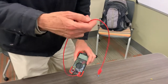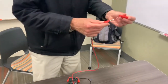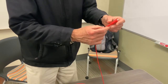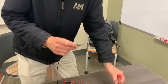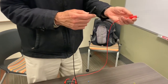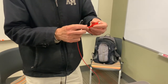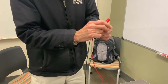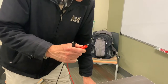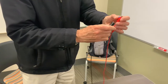On the other side, we're going to insert alligator clips. You have to make a good connection to the alligator clip — push it onto the clip, you may have to push on the metal to get a good solid connection. Do that with both the red and the black. Conventionally we have red for the high voltage side and black for the low voltage, but that's just so you can keep track of it. Once you have the alligator clips in, you can squeeze on the spring-loaded clip — they open like the jaws of an alligator, hence the name. Connect one to one side of the resistor and the other to the other side.